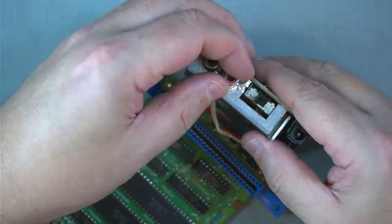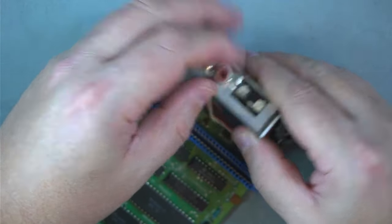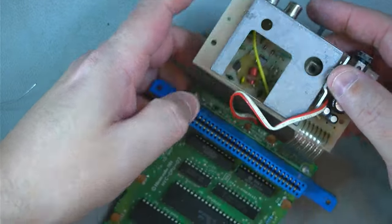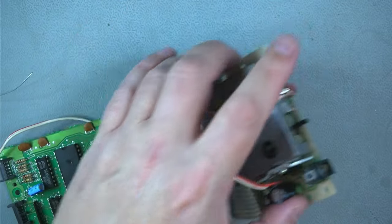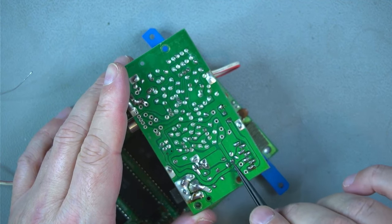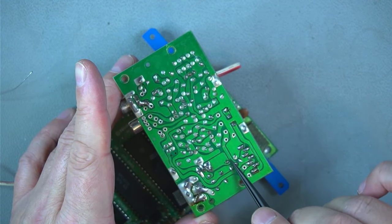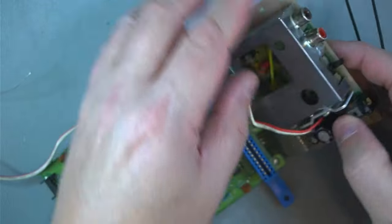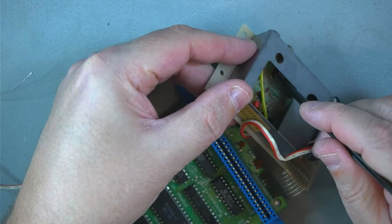It's all done. Soldered all around, including the lip. Just an advice — use the biggest tip you have and make sure you heat up both the shield and this thing. They both need to be heated, otherwise they won't stick. This is now rock solid, it doesn't go anywhere. I can put it right in here and it sits really nicely. One thing you could also do is add some sort of metal at the bottom as well, just to make sure it's 100% solid. Word of caution: if you heat this up, this plastic will most likely melt. So if you want to solder this permanently, plug the cable in first and then solder it — this will prevent the plastic from deforming.